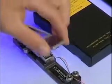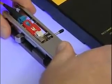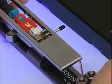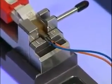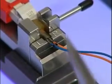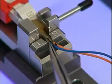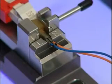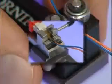Carefully flip the crimp handle 180 degrees until it contacts the crimp tubes. Push down firmly on the crimp handle to secure the 900-micron buffer. Do not be concerned with over-crimping here. There is a positive stop on the crimp handle that will prevent the possibility of over-crimping the lead-in tubes. Flip the crimp handle open. A flat impression should be visible on the crimp tubes. It is important that the connector is properly crimped to ensure that the specified amount of strain relief is achieved.